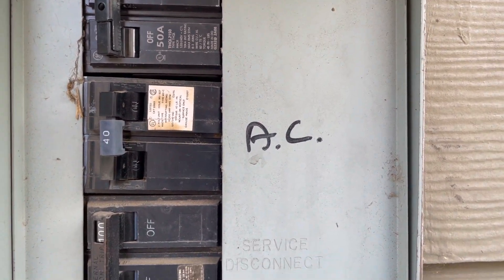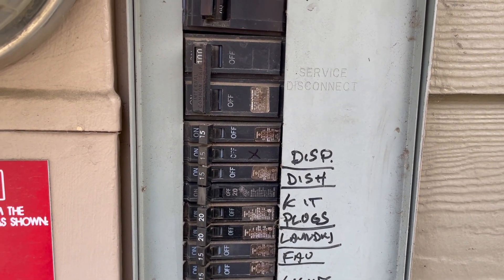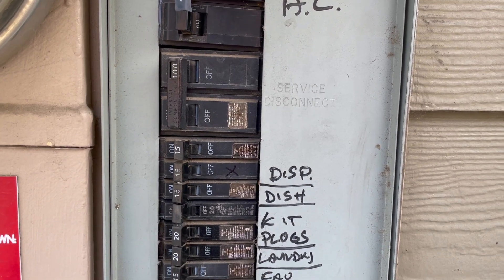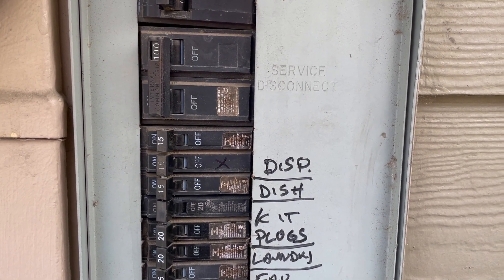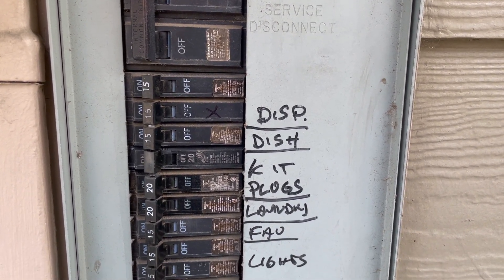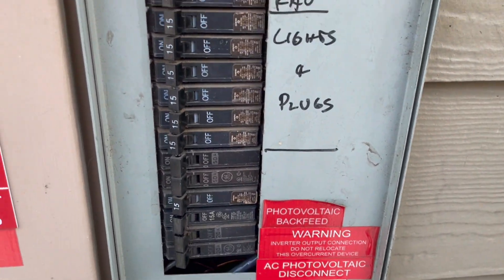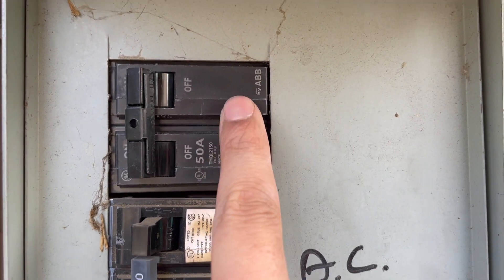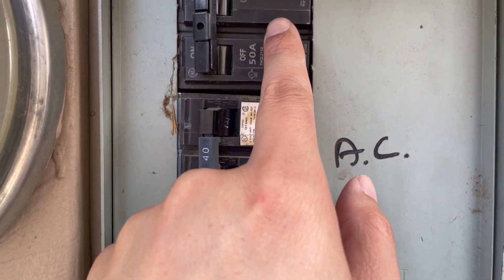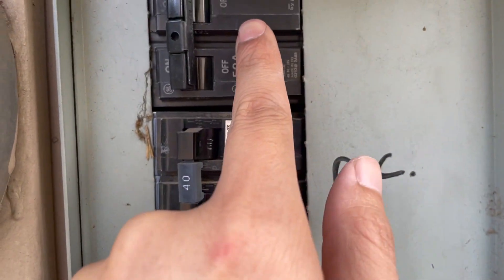With 50 amps I'll have a little buffer. Everything else in the house isn't pulling too much electricity — nowadays lighting is like 5–15 watts LED compared to over 100 watts before. The main high-draw items right now are heating the aquariums and reef tanks. Originally I had an empty slot and a 15-amp breaker up here, but the panel is pretty full and I had to figure out how to move the thick 15-amp breaker down and open up a dual slot.